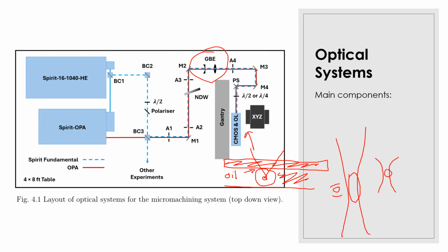To avoid this, we have to set the beam to be slightly diverging or slightly converging to compensate for the thickness of all of the material prior to the focus in our actual setup that we're focusing through.